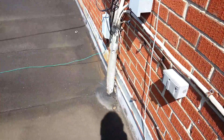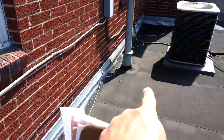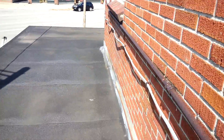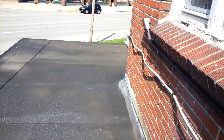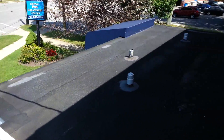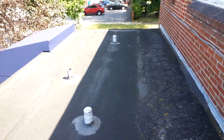The flat roof just wasn't installed right. There are a few terminations we have to worry about where some exhaust comes through that we have to pay special attention to. I'm going to go up on the upper roof and see what that one looks like. This really should probably be done with an EPDM — a complete rubber system — which would be their safest bet.